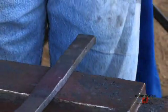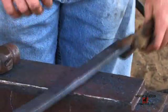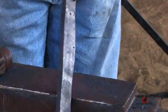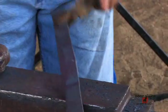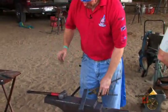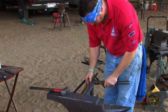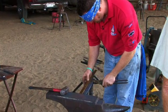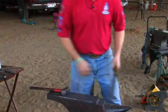When you make the toe bend, all the molecules get compressed on the inside edge. The outside edge, they get stretched and pulled apart and thin. So I'm compensating. This is not going to get as thick, so it'll be a lot easier to get rid of my sole pressure now. That was about 3/4 inch also.